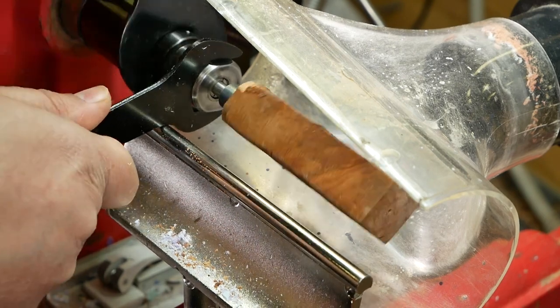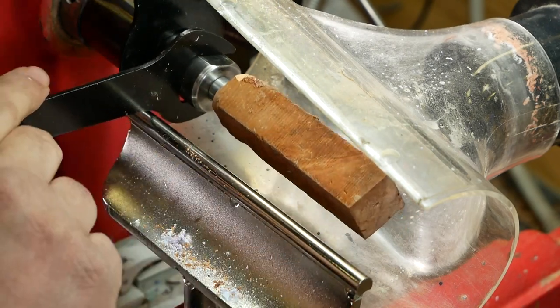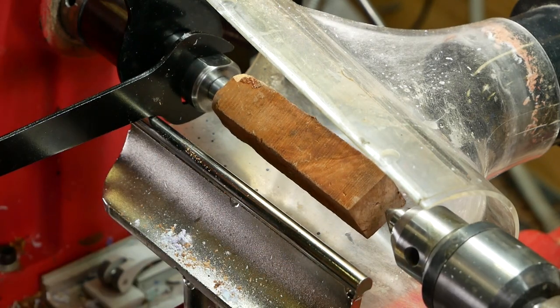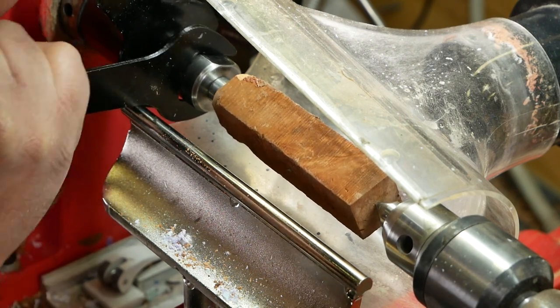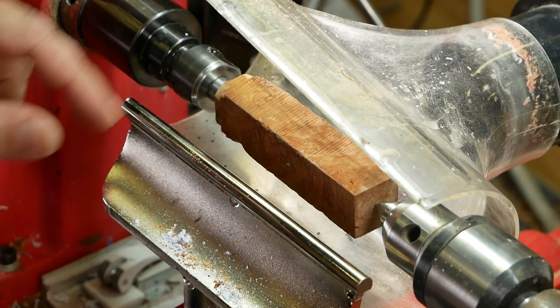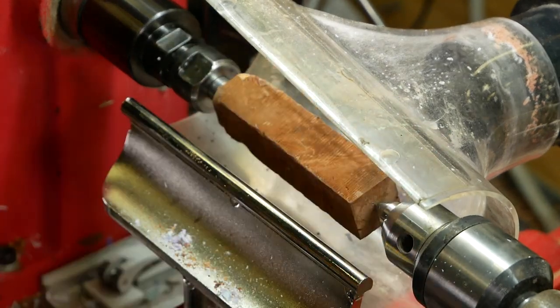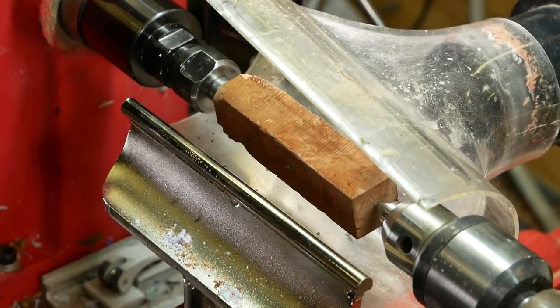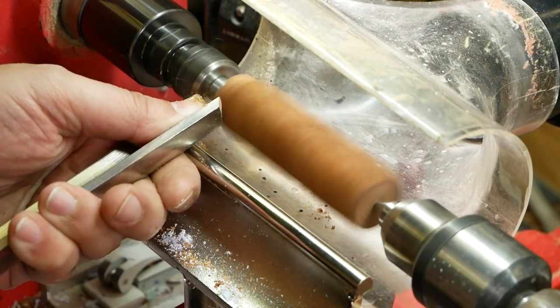Loosen the collet so the rod can slide. Use the tailstock to push everything against the chuck. Now use the wrenches to fully tighten the collet. And finish threading the barrel onto the mandrel so it is tight against the bushing and the chuck. Readjust the tailstock if needed. Proceed to turn a straight profile close to your final diameter.